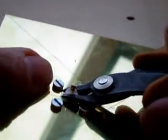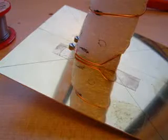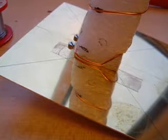Remove the insulation material around the connector pin until the top is around 1 millimeter above the brass plate. Solder the wire horizontally to the pin using the insulation as a support. After soldering, remove the excess wire at the connector and at the end of the antenna with a cutter. The wire must run 1 millimeter above the metal plate over a length of 30 millimeters before following the spiral shape.